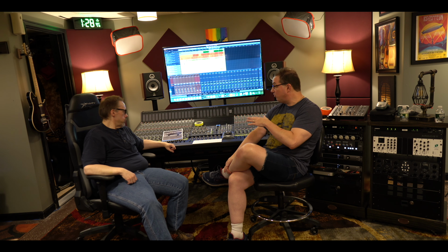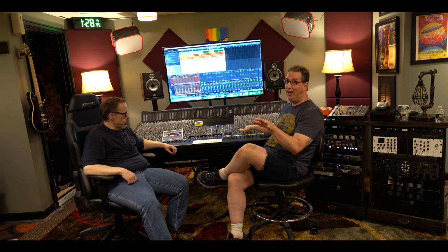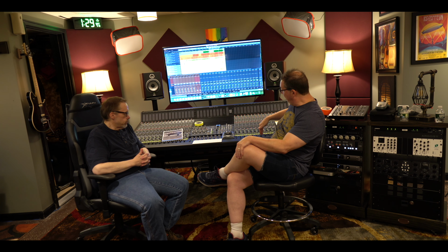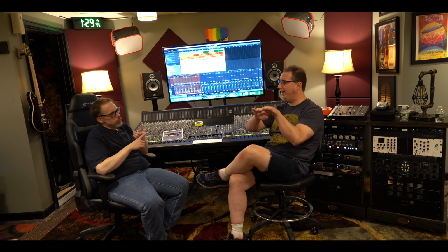But as we talked about, this board is actually capable of 64 tracks of mixed down, not 32. There's 32 long faders and there's 32 short faders, which we're not using any of right now. But in order to do that, we need more I/O. Yeah. So we're considering getting one more 8-in-8-out I/O just for the effect returns. And then that will free up the last 8 channels on the board. It gives 32 long faders of audio. Yeah, and then we can, if we had extra tracks. Yeah, because we can assign those 8 effect returns to the short faders, freeing up the long faders for the actual channels.